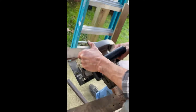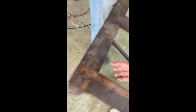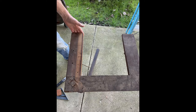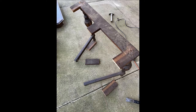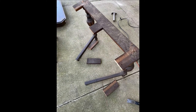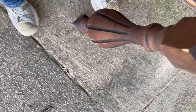Using the circular saw again, we're going to cut right along the line where the two frame pieces connect. The reason is we want to cut down the short piece and reuse the long piece for the back legs. So there are the tools that we've used. There's the leg that we've disconnected from the frame, the frame that we're getting ready to cut down to size, and there's the frame once we've cut it down. This will allow us a base to attach the legs to. The front two legs are still attached, which is great — we'll just have to create back legs. Here's a close up of where those were disconnected from the leg — that will have to be sanded down before I can paint it.